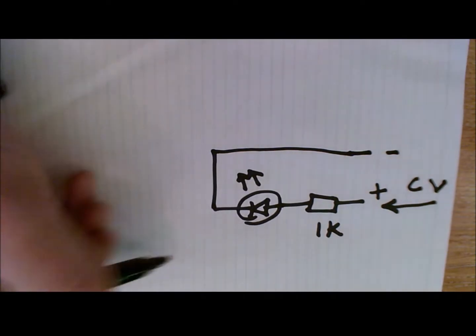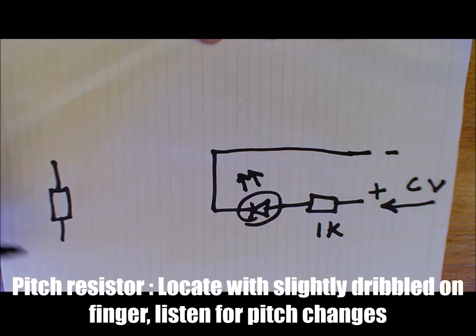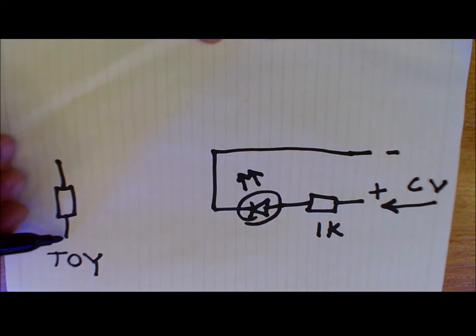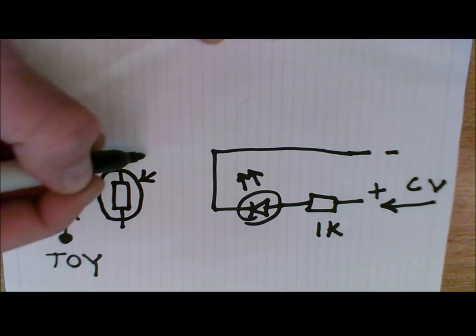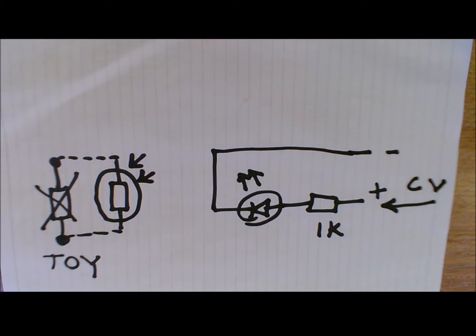The other side, the LDR, well, what you'll be doing is replacing a resistor that will already be part of your toy. So you're going to be either removing that or replacing it with your LDR. In terms of the points, you'll still need to keep those same 2 points even if you remove that resistor. The LDR then goes in situ, and like we said, that LDR is responsive to the light of your LED. That can then be soldered in place. You can, as I said, choose to substitute in a switch, and that will be something you'll have to have a play with, but that is the sort of very basics of it.